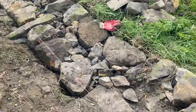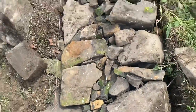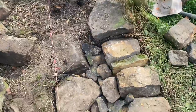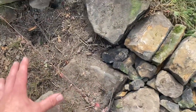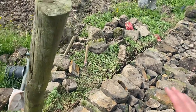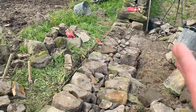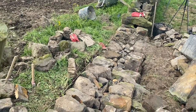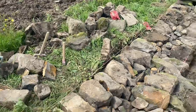The footings are in now — nice and sturdy all the way up, you can walk on them. Some bits still need pinning, but that's the reality of walling. What I'm going to do now is build a pillar up to half height and then fill that section through. I do it this way because both existing walls are wonky — if I wall directly to them it'll be wrong. You can use metal stakes, but I don't for field walling — personal preference. I'll build two pillars up to the height where the throughs are, and wall that middle section through.